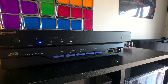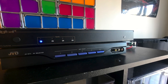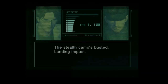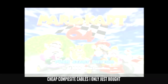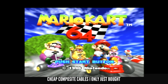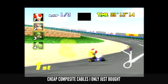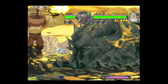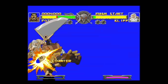If you have more than one console in your setup, then using a switch box will allow you to connect them all to the one display. I personally have two switch boxes — one for my Composite consoles and one for my Component systems — meaning that with a press of a button I can send the signal from the console I want to play to my RetroTINK, without having to rewire anything. Like cables, it's important to go for quality equipment here, because cheaply made switches can degrade the signal and introduce latency. There's no point investing in expensive cables for your consoles to then plug them into something that degrades the signal. The good news is that AV switch boxes are easy enough to come by and pretty cheap, and you can even find premium units second hand as many high-end setups have migrated to digital hardware.